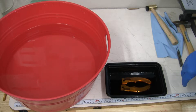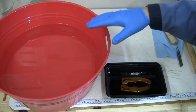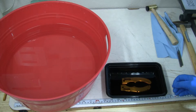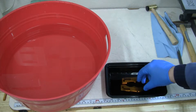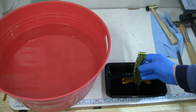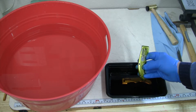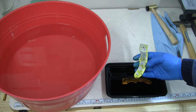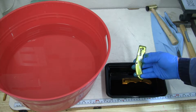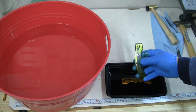We're gonna pull these out of here. I've got a bucket of water — we'll make sure we rinse them and see what happens. It looks really cool, like it's dying them a golden brown color, but supposedly it's not doing anything to the titanium, so we'll see. It looks like it's just gonna rinse off and leave them totally clean. Obviously if that were steel, they'd be totally black by now — with steel you only put it in there for 10 to 20 minutes to get a totally black color. So here we've got pretty much nothing on the titanium.